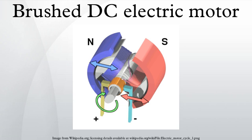Compensation for stator field distortion. In a real dynamo, the field is never perfectly uniform. Instead, as the rotor spins it induces field effects which drag and distort the magnetic lines of the outer non-rotating stator. The faster the rotor spins, the further the degree of field distortion. Because the dynamo operates most efficiently with the rotor field at right angles to the stator field, it is necessary to either retard or advance the brush position to put the rotor's field into the correct position to be at a right angle to the distorted field.